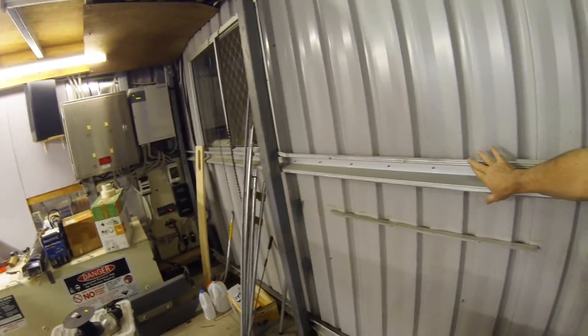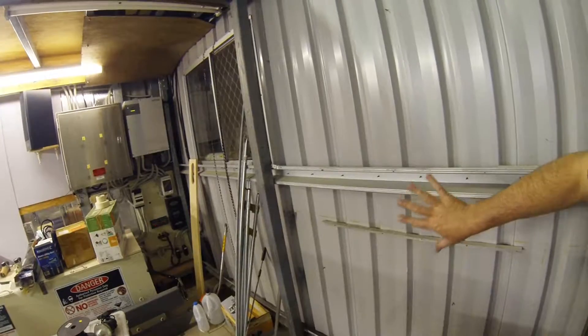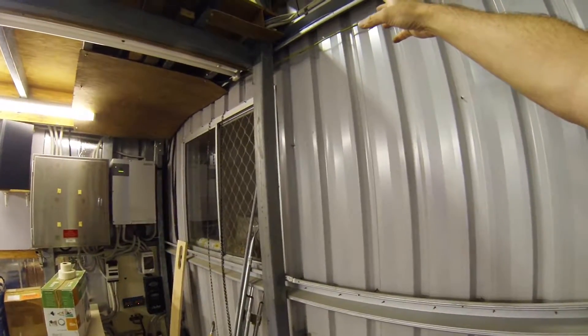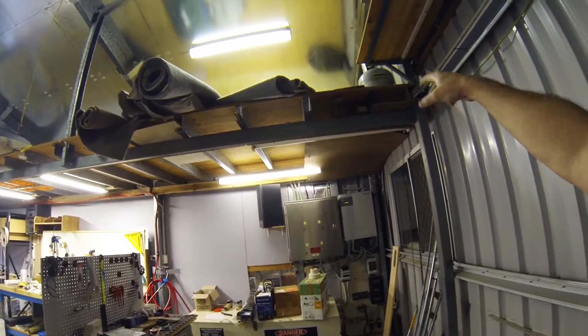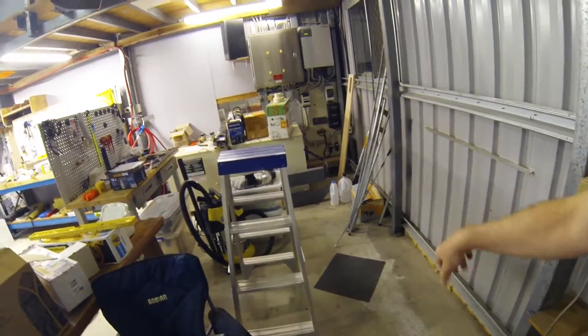The battens will go against the purlins here, and then on top of the battens will go structural ply the entire way up, so that'll be my solid support. It'll be inside of the straps here for the lift, and the idea is that it'll go level once it's taken up to the top of the floor there. So I'll be able to just slide the stuff onto the platform.